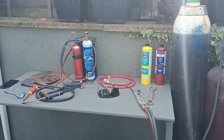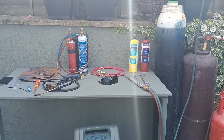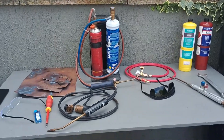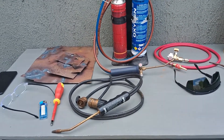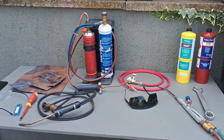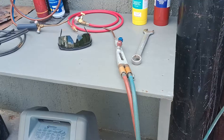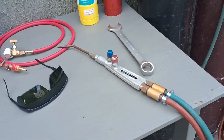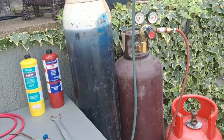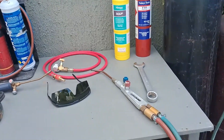I've been looking at using different gases including map gas, propane, mixtures of propane and butane, and some of these mini kits — there's a Benzomatic, a Walkover 555, and a couple of others I've got in the shed. I do like to use where possible your original full-size torch — this is a Sapphire welding torch from British Oxygen — and your standard pipes, if you can use those with a different gas or system, I think that's even better.